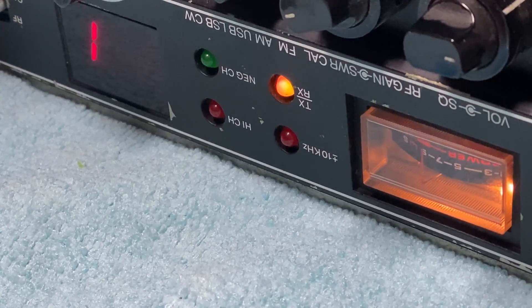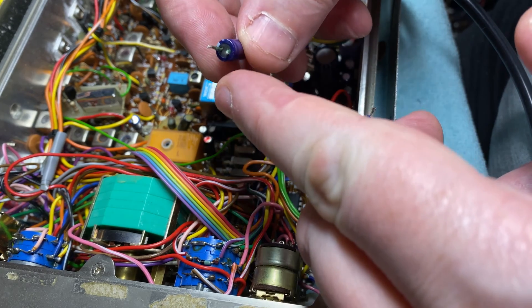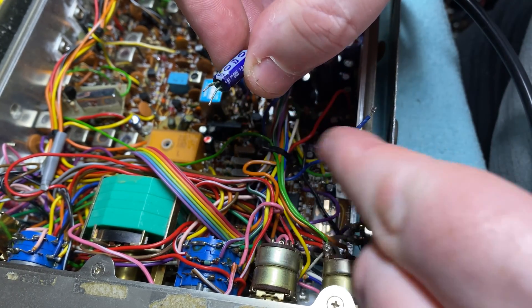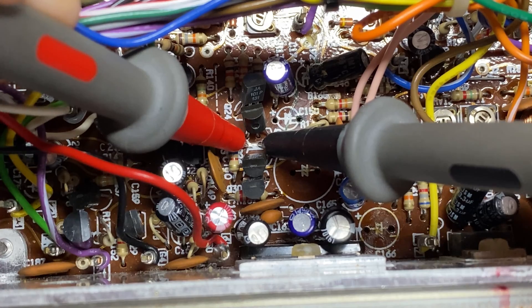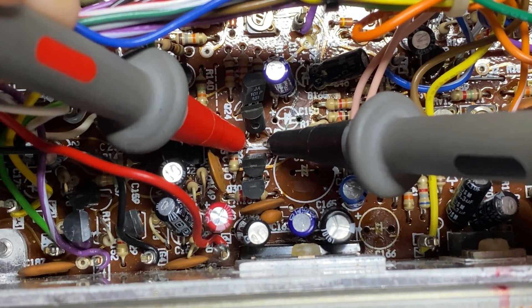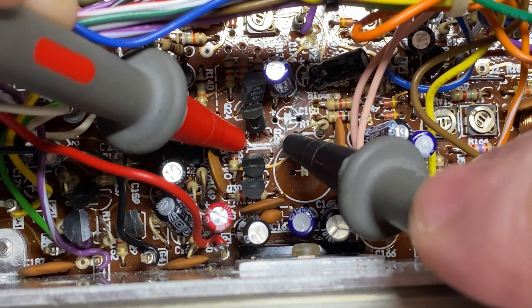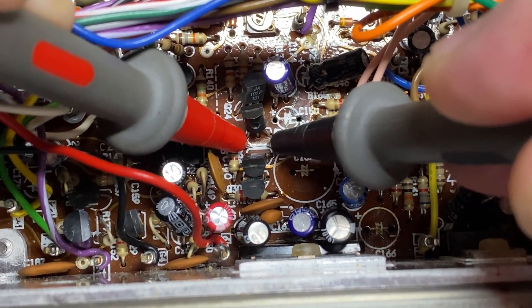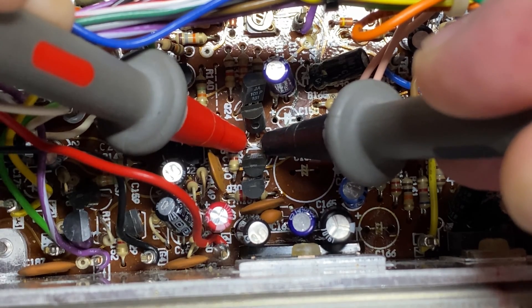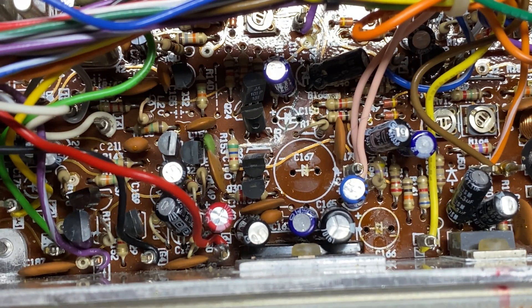Switch the bleep on — yes, it's working, so the bleep is fixed. But we've still got an issue with transmitting and receiving. We start pulling out suspect rotten caps and sure enough we find rot on the board. As you can hear on the meter we have a broken trace. I couldn't actually see this break even under a loupe, but the meter was showing it's there. We'll put a bridge wire across it — luckily the service manual shows the top traces so you can cross-reference and bridge it on the back.